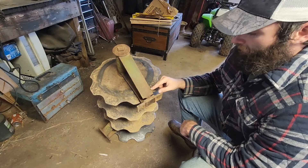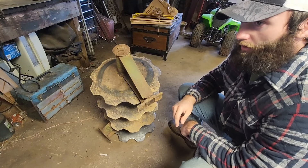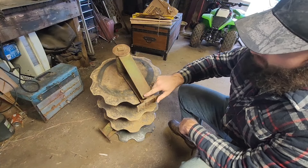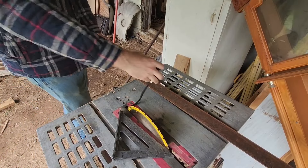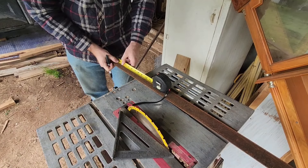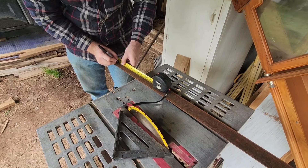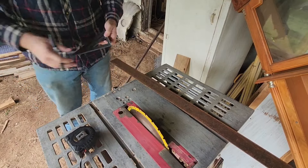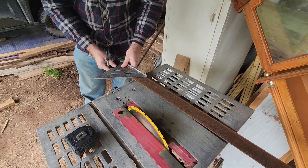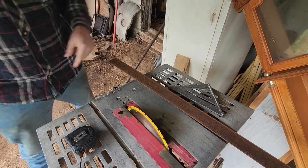For now, we're going to go out there and use an angle grinder and cut two two-inch plates. Might hold off on cutting one now, but we're going to cut them and then start coming in here and cleaning all this up to get ready to weld everything up. I'm going to do a little bit more than two inches — probably about two and a half. Make a mark there. That's not going to be perfect, but I'd like a little bit more metal than not enough. Take the speed square and mark this thing up just so I know where I'm cutting.